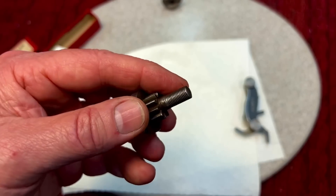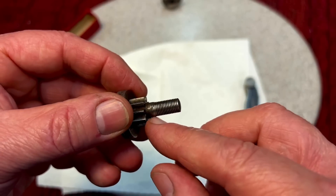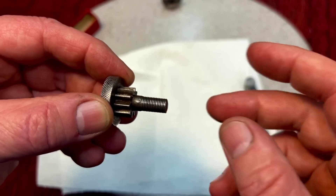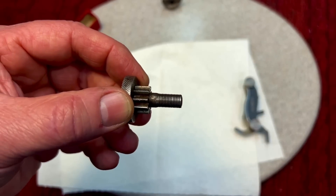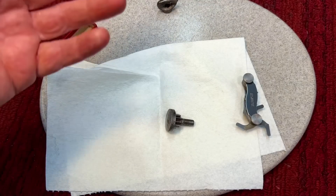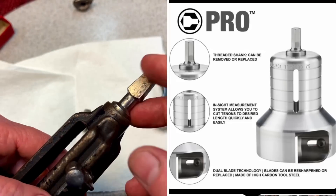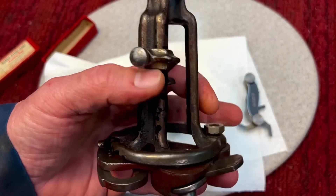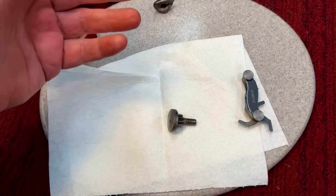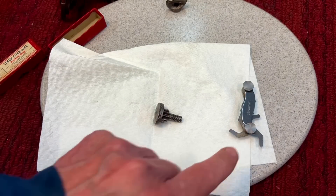This isn't a high-stress area — you don't have a lot of pressure here, you're just trying to hold it tight so it doesn't slip. So we're okay if we go down a little bit. What we're going to have to do is put this in a lathe, take it down, re-thread it to something that we have, and then make another thumb screw — and that'll save this tool. Now, if you were doing a heirloom restoration or this was a rare tool — these aren't rare — we'd be more careful, but we still want to save it without spending $50 worth of special tools.